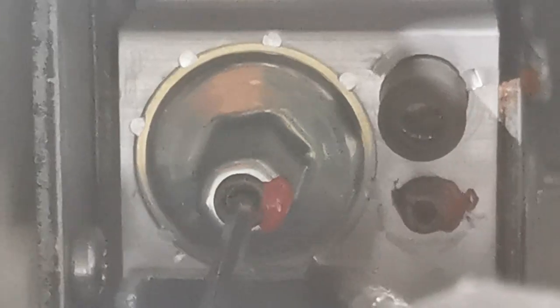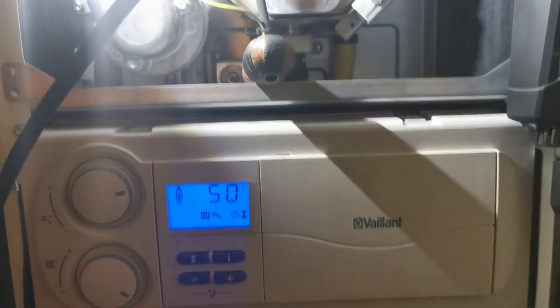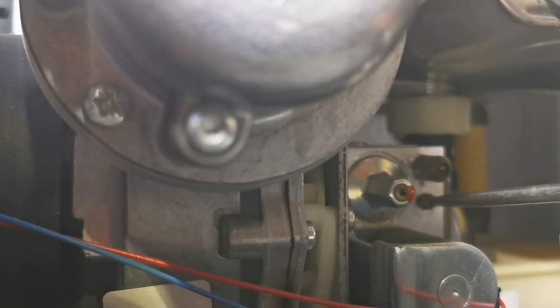Check your MIs for specific readings that you should be getting on the CO2. The parts per million is usually 200 or under; some models are 300. Check your manuals for the minimum and the maximum - you have a bit of tolerance as well, but try and get it as close as possible.